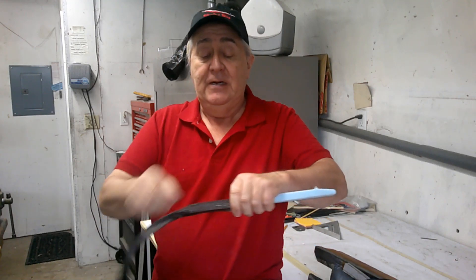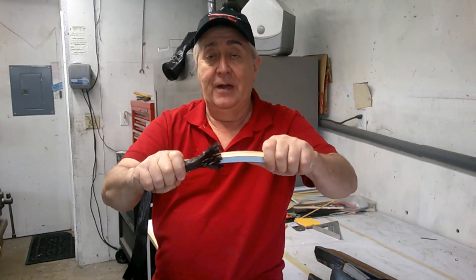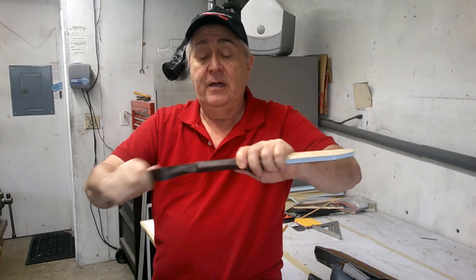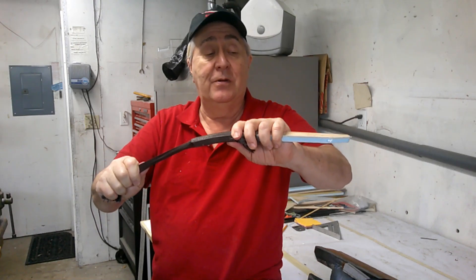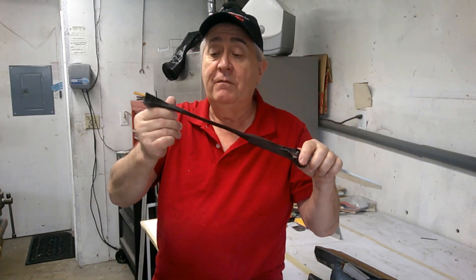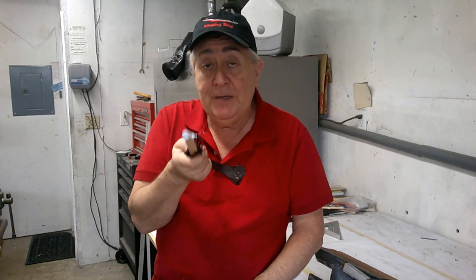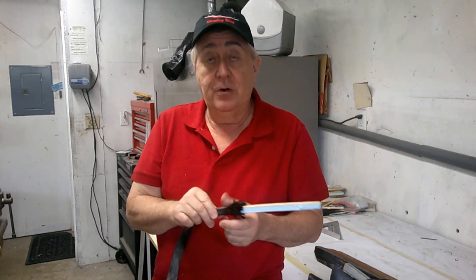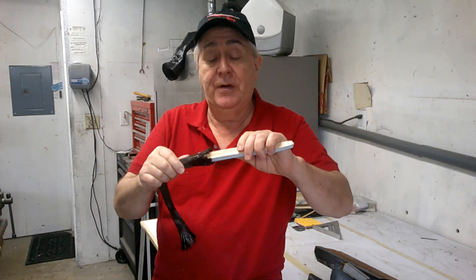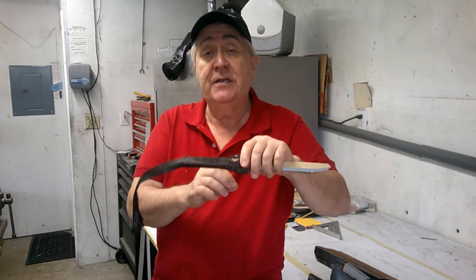Then you can bend it on a mold because it's one continuous sleeve, and the type of weave is very flexible. If it's pulled tight, it's going to stay in place as you put it on a mold. That would have been a hundred times easier than what I had to do. So if you ever need to make ultra-lightweight ribs for your ultralight aircraft, whether powered or glider, give this a thought. Consider the core material you're going to use, whether you'll add balsa, and use these sleeves — just slide a sleeve over it, wet it out. Ta-da! You've got a rib.